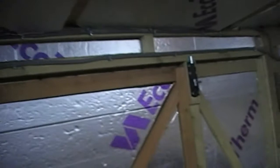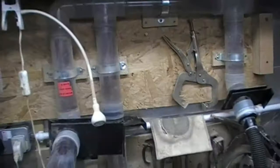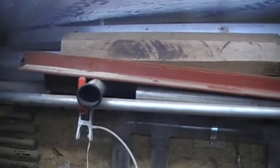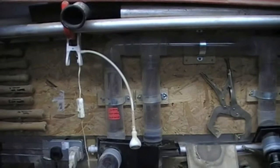It's got nice LED strip lights, which is great. Just inside the door we've got this cyclonic dust collecting system. There's the vac at the back — the orange thing — and then the cyclone, and it's connected up to all the pipes which are made of clear plastic. They go right around the shop to the other side, with plenty of ports on each side all around the shop to give suction. There's also a little sweeping box on the floor here connected to the dust collection system, so you just sweep stuff in and it gets sucked up into the bin. A lot better than messing around with a dustpan.